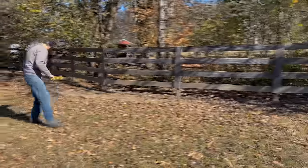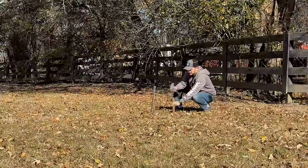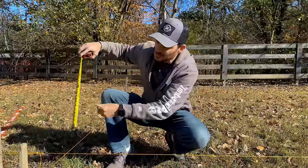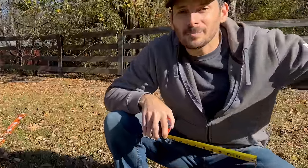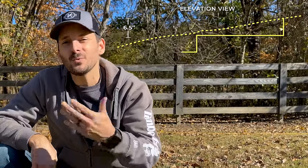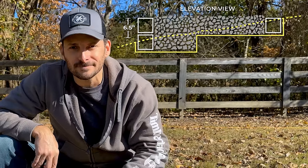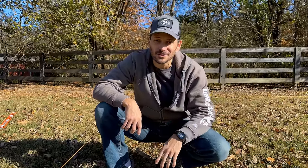When you're trying to figure out where to put your shed, site selection is so important — you really want to find the most level ground you can. You really don't want the difference in your site to be more than the height of the timber you're using. I'm using four by sixes on edge, which is five and a half inches. Over here it's twelve and a half inches off the ground but on the other side it's six inches, meaning a six and a half inch drop — that would require another beam and backfill to act as a retaining wall. The flatter you pick your site, the less material and hard work you'll need.